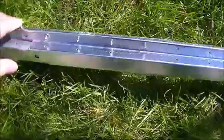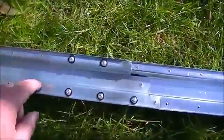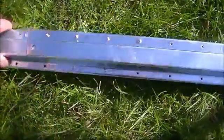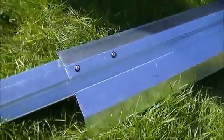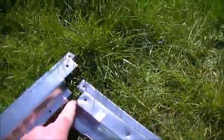This is the side rail we're back onto now, and again 230 mil is the quoted overlap, and it's 1, 2, 3, 4 screws on the leading edge, and 1, 2 screws on the trailing edge. Again screwed from underneath, and ensure that you've got the corners stepped down inwards, almost a mitered corner if you like, to the next corner. This is the front rail here with the step through plate, just 2 screws holding that together, and as you can see, each of the corners basically has to align with a mitre joint to meet up with the next corner.